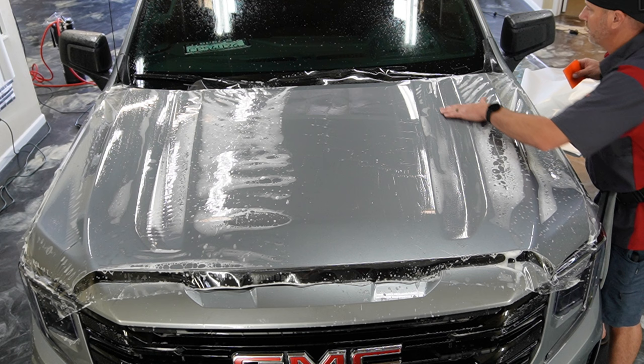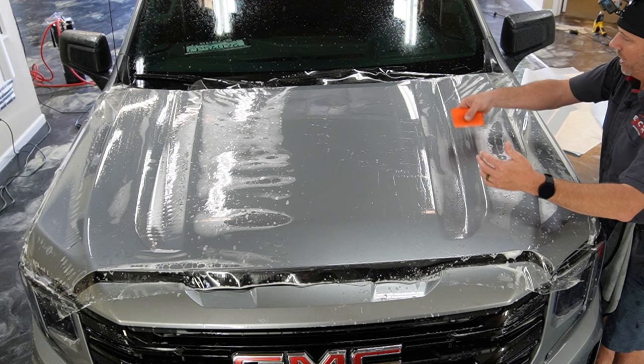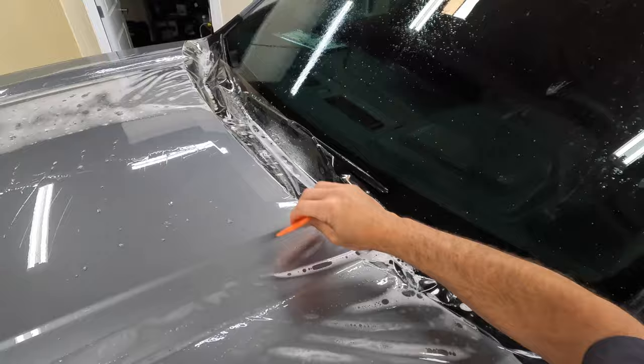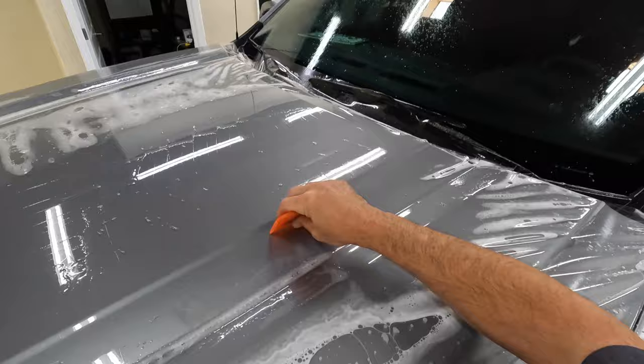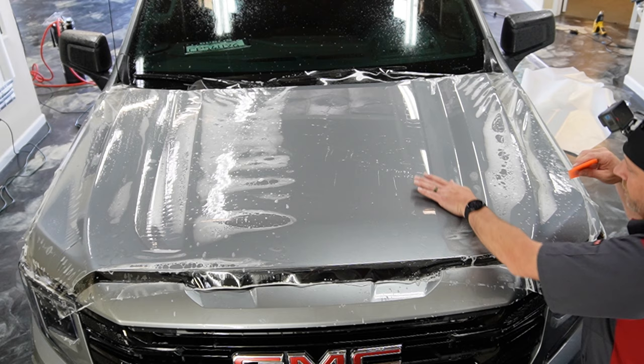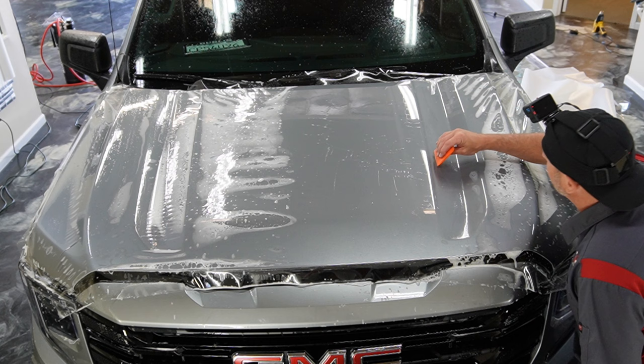Let's get rid of some of this excess moisture or slip right now, and then we'll go ahead and squeegee this out. What I want to do here is bring all of this — I'm not going to take much of it that way, most of it is going to be brought towards me. Just make sure you get good, even pressure when you're going over this ridge and then dropping down, and then same thing through here — you want to hit that valley and then come up. I'm going to go ahead and push some of this out the front; don't necessarily need to tack that down right away.